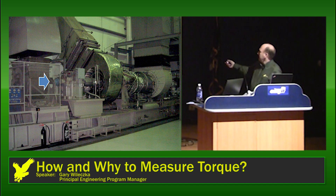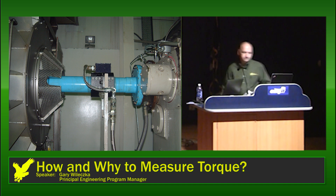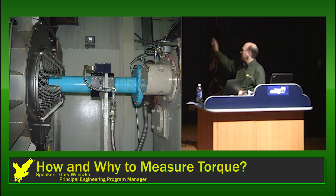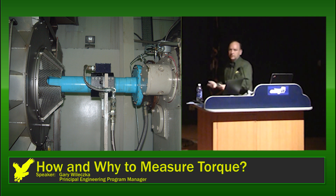Here we have a test stand for a small gas turbine. We have an intake over here, and this is the exhaust area. This is the load over here, which is a pump, and in here — hard to see in this picture — there is a coupling with a torque metering system on it. A coupling is a spacer tube, hollow tube usually, with flexible elements on the end. It's kind of like a pancake where you bolt the outside and the inside is attached to the shaft. This allows for some misalignment between the two pieces of machinery, and also allows a certain amount of stretch and compression as either the load or the driver heat up and expand.